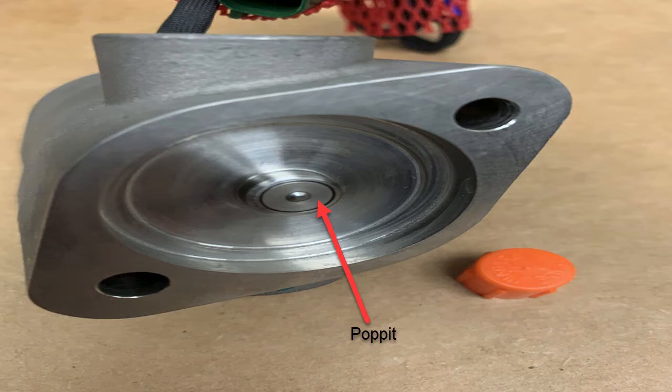This injector has what's called a poppet in it. If you see that insert that looks like it's pressed in, that's the poppet. The poppets are the new style injector and they're supposed to be self-cleaning — they do a pretty good job of it. On the older ones, you had to take it off and clean it with a brass brush and some decarb until the tip was nice and clean, or it wouldn't spray properly. They tried to get away from that and it's been fairly successful with this.